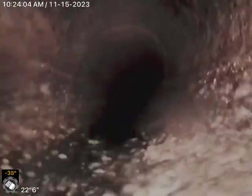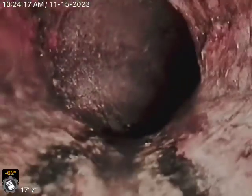Oh, that's cement, huh? Yep, we are transitioning outside. I'll pull back towards the transition so we can get a more accurate assessment. So we've got the concrete aggregate right here — roughly 18 feet, we're transitioning from the cast iron and going to another material, the concrete, that's going to run outside. We've got a little bit of a crack right here on the concrete pipe. That's definitely going to be a concern.